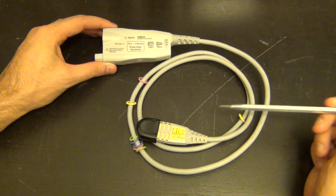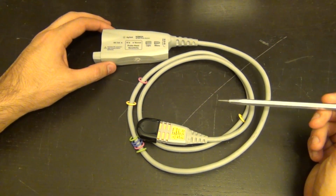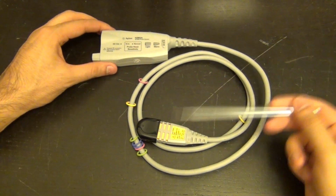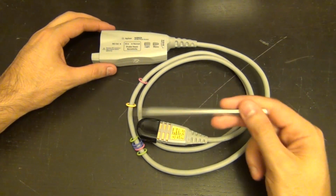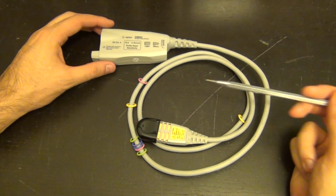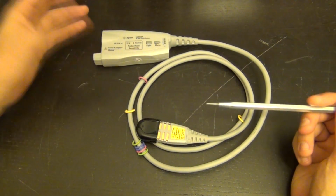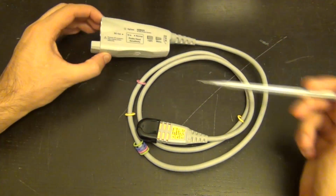Now, all the InfiniMax III series probes from Keysight, which offers one of the broadest range of accessories that I think on the market, as well as the highest bandwidth, they all have the same interface, and they can connect all to the front-end amplifier. And you can see there's a light switch here, and if you have the browser head, then you can actually turn the light on, see what you're doing. Very, very sophisticated bunch of stuff. I have shown an active probe at lower frequency when I was doing the review of the S-Series scope, but this obviously has a different mount, so you cannot connect that to it. You can even connect this to a spectrum analyzer with the proper adapter, which then powers the whole thing.